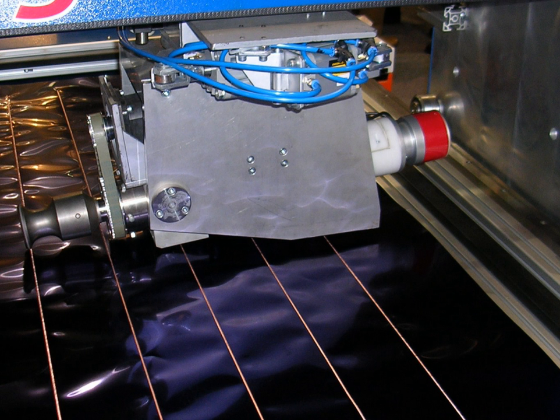In ultrasonic welding, there are no connective bolts, nails, soldering materials, or adhesives necessary to bind the materials together. When applied to metals, a notable characteristic of this method is that the temperature stays well below the melting point of the involved materials, thus preventing any unwanted properties which may arise from high temperature exposure of the materials.